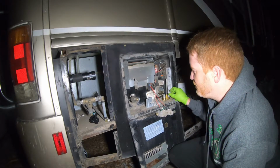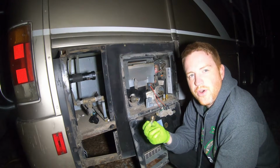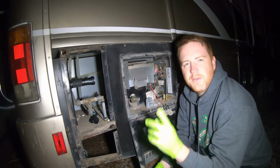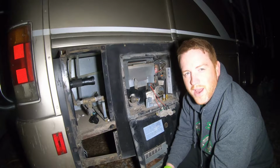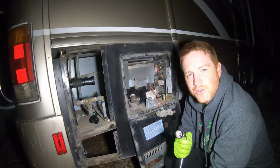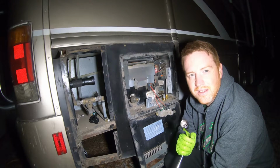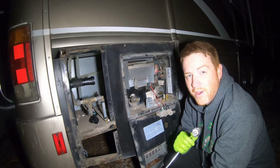Now the instructions are very clear. You will need to install the adapter first before you install the rod. And before you do that, make sure you apply some Teflon. Now one tip I'm going to give you is, guys, be gentle with these brass fittings. This setup is not meant for you to gorilla these fittings in there. One or two turns will be more than enough. You just need it in there for it to not leak. If you overtighten it, you will snap these. Thus why I'm on my second one.